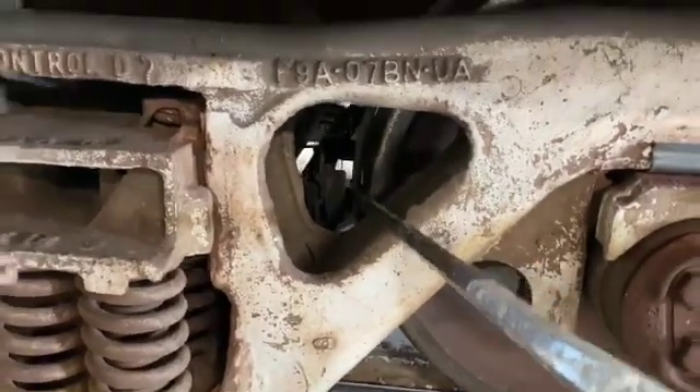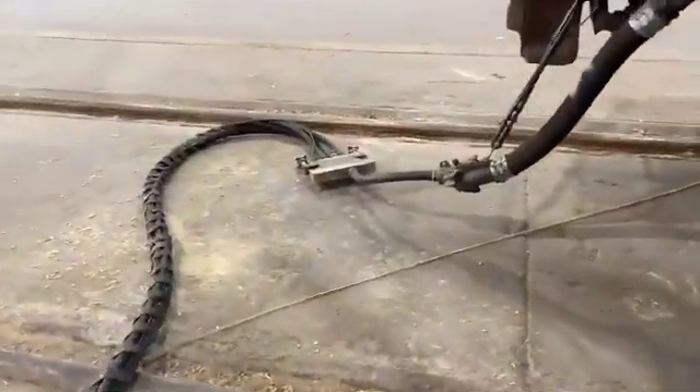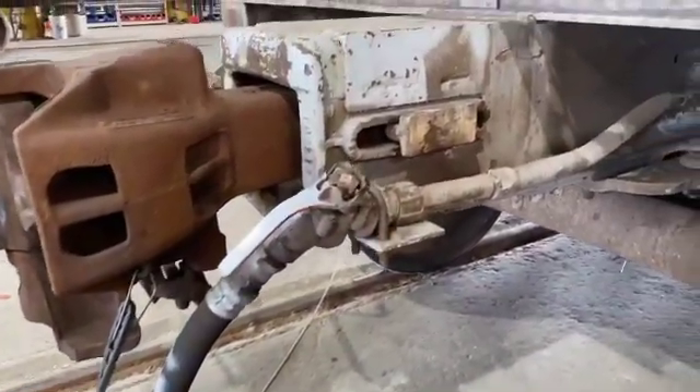We're going to be cutting out a car in this video. You can see a brake bar in between the brake shoe. The brake shoe has been pried back. We've got our air connected to the end hose, and our angle cock is open.